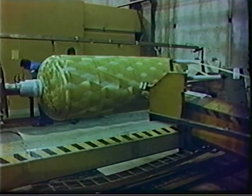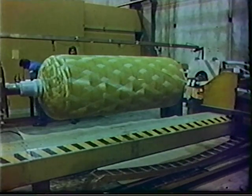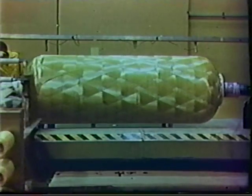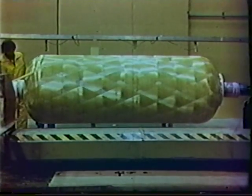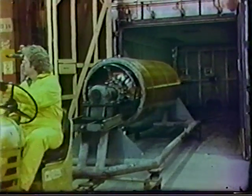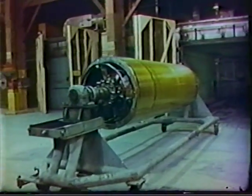When these steps are completed, the mandrel is removed from the WEI machine and moved to a filament winding machine. Case winding is done using the same method as that used for molded insulators. The case is wound over an uncured insulator rather than a cured one. After case winding, the completed case and insulator are co-cured in a single step using the standard Pershing II thermal microwave cure schedule.